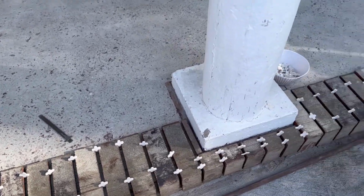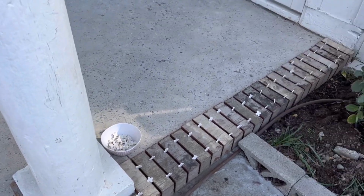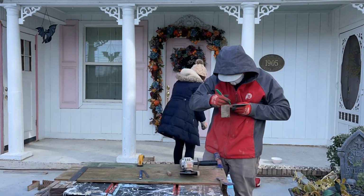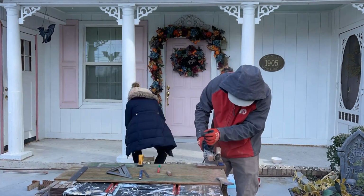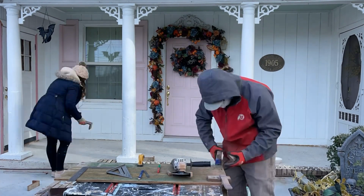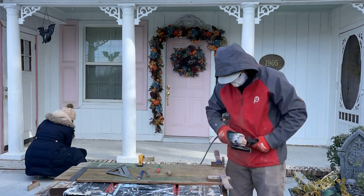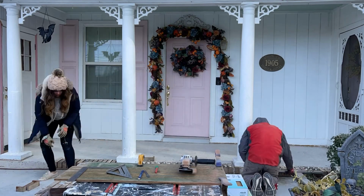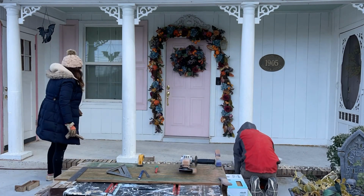Okay, so now that we know our layout, we pulled off the big brick web sheets from the back, and we actually pulled off everything but then we ended up putting the front pieces back, so I wish we wouldn't have pulled those off, because the weather is a little bit crappy, so it's too cold to use the tile adhesive. It needs to be 40 degrees or warmer for the whole laying and curing time, so for at least 24 hours.